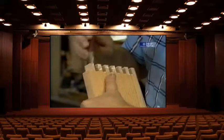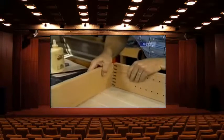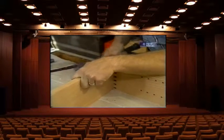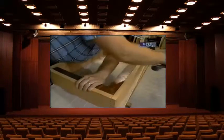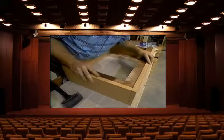A little yellow glue spread out with my brush, and I'll fit these corners together using gentle persuasion from my rubber mallet. I'd better check that case for square before the glue sets up. I didn't forget the clamps — the joint is tight enough that it's going to hold itself together, but I'll let the glue set up. Then we'll go back and look at the prototype and start working on the face frame.